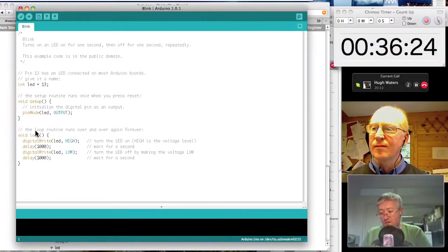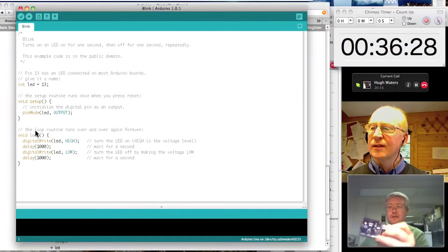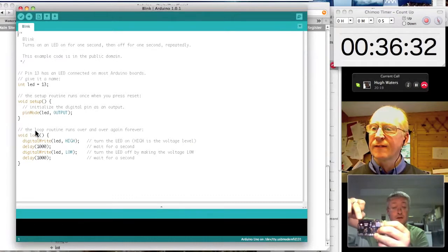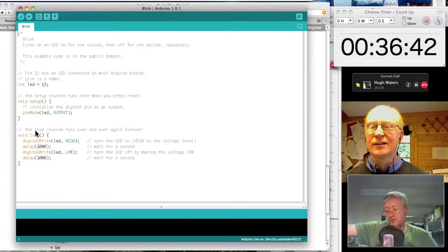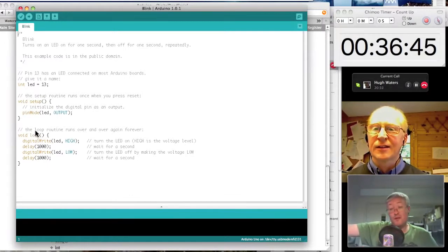And so they're the digital output lines there, and on the bottom connector, so the digital output lines across the top, digital outputs and digital inputs, so it can read digital values and it can output digital values, and then we've got some analog inputs and outputs on the bottom. So there's a couple of A to Ds and D to As on the board, as well as a serial port. So that's remarkably useful.